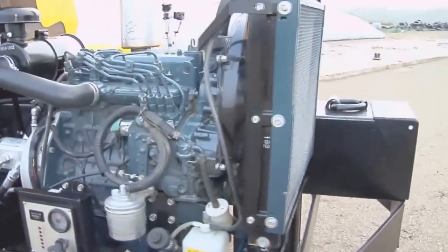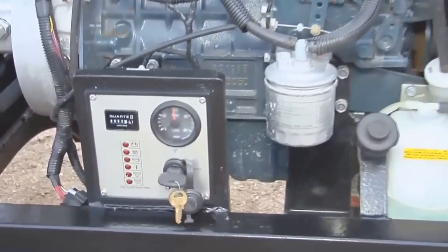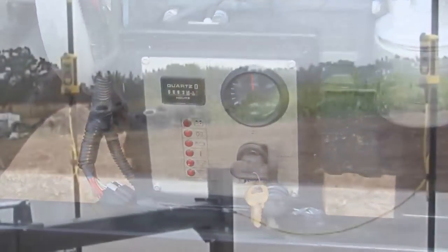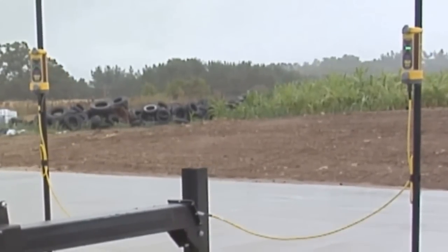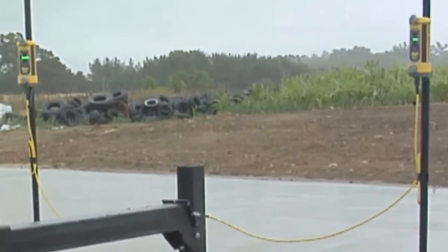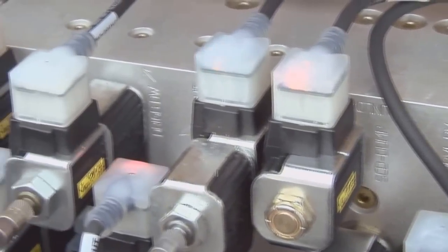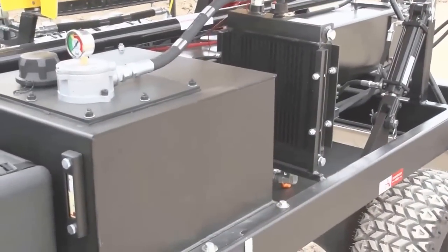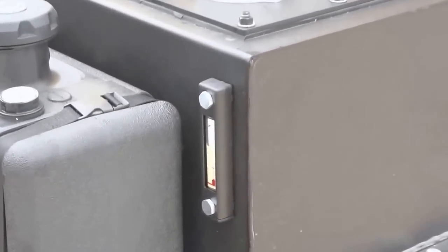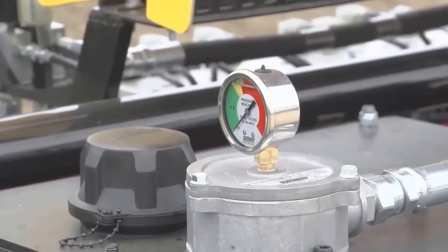We power XT with a four-cylinder, 35-horsepower Kubota diesel engine complete with radiator, electric start, and diagnostic feedback panel. Every ScreedSaver ships with two high-precision Trimble LR-30 laser receivers with a built-in 360-degree range of sight. We incorporate a state-of-the-art hydraulic distribution manifold with every machine function controlled by Parker proportional valves that light up when activated. Reliable operation is ensured by a fan-cooled hydraulic fluid system incorporating multiple filters and an array of pressure and temperature gauges verifying fluid integrity at all times.